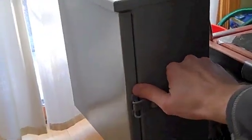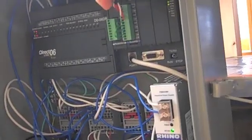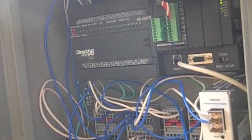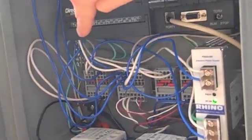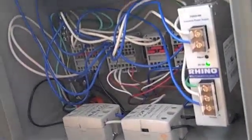The control box here is bolted to the stand. That's all wired up inside. The space is a little tight — wired up to a PLC. The temperature sensor is going in there, and most of the digital outs control the pumps and grow lights and so on. On the inside, the float switch goes in there — it tells me when the grow bed is filling — and a couple of solid state relays to turn the 110-volt pump on and off.